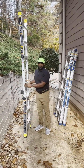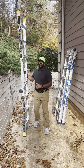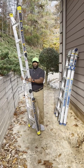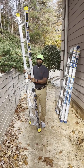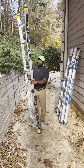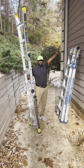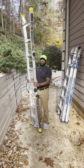And sometimes you may need to do a double pull. I don't recommend you doing a double pull. A double pull is when you climb up on one ladder to the first floor, you carry the smaller ladder up, and then you put a smaller ladder on the wall to get to the second roof. Some IA firms like A. Renfro do not want you to do that. State Farm do not want you to do that. So that's up to your discretion. They'd rather you have a really big tall ladder, just go straight to the second floor. But I've seen adjusters and roofers do a 2-ladder pull.